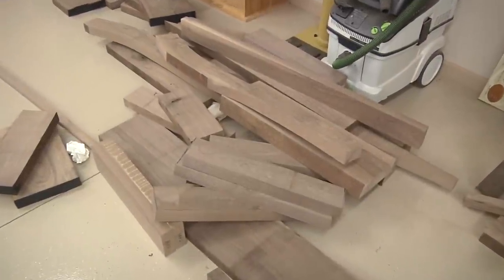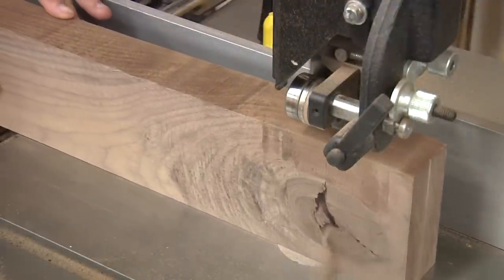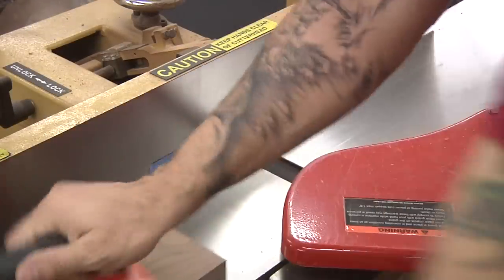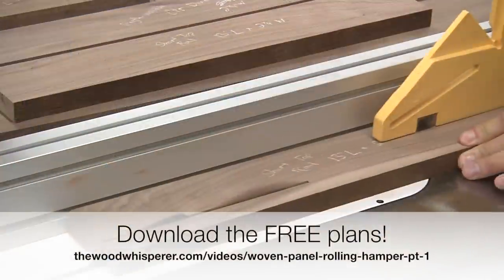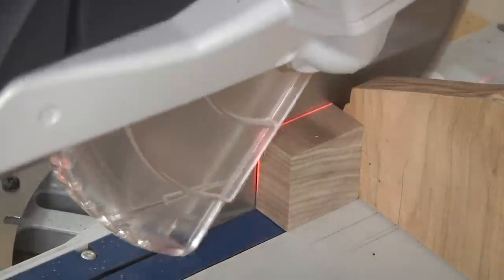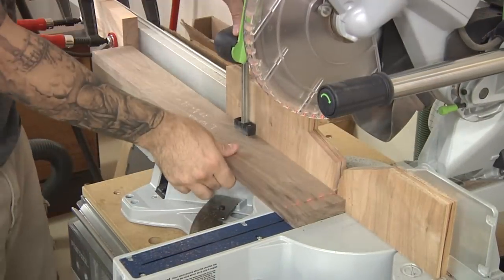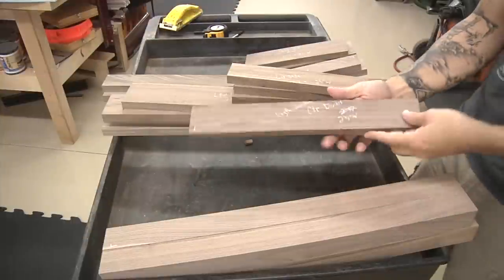This amazing pile of walnut offcuts came from my recent sculpted rocker project that we did in the guild, and it's the perfect pile of material to pilfer for this project. I had to cut down a lot of eight-quarter stock to make four-quarter frame parts. You might think that's wasteful, but nothing's more wasteful than a board sitting on my shop floor unused. The legs on this piece are an inch and three-quarters thick, so the eight-quarter stock was perfect. Everything is cut to length at the chop saw using a stop block for repetitive cuts. The center divider will be cut to length after we do some dry assembly, so set that aside for now.